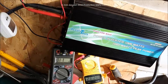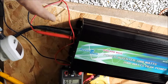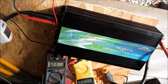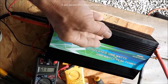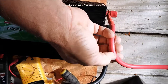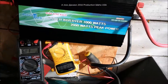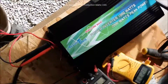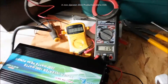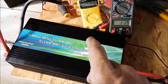Look for the 1000-watt or 1500-watt versions — they're really just an extended version with more MOSFETs and more small components. These go up to two, three, or four thousand watts. Honestly, you don't need a huge one. Buy two of these and use them for individual items. If you have a refrigerator you might want one that can handle 2000 watts with much larger cables. If you're going any length at all, don't use the copper-clad aluminum cables these come with — swap them out for real copper. I give the Accurate Tools a seven — not bad, worth buying. Next video will be hooking this up and letting you hear why modified sine wave is a little rough.